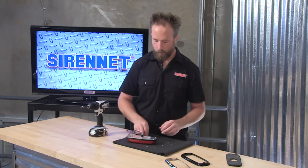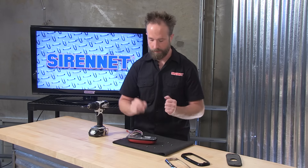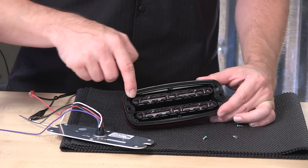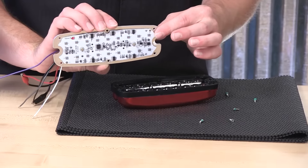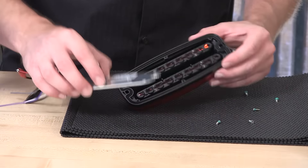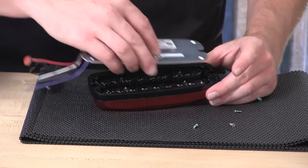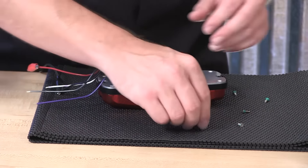I'm going to go ahead now and reseat the mounting screws into it to join the backing electronics assembly into the three-piece fused together lens assembly. Because there is a gasket that goes into the lip here and again onto the aluminum backing piece, I'm just going to quickly make sure that that is aligned and pressed into place as needed. Then I can realign the aluminum backing.